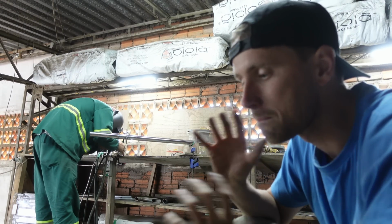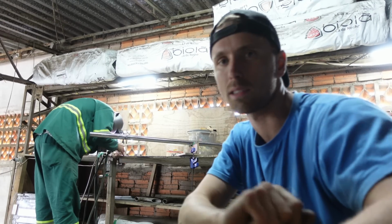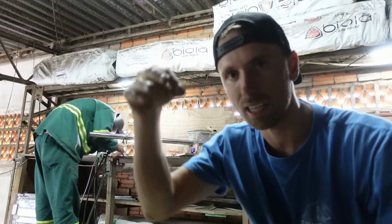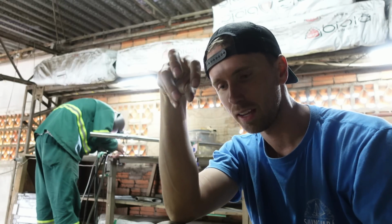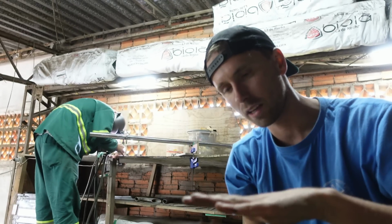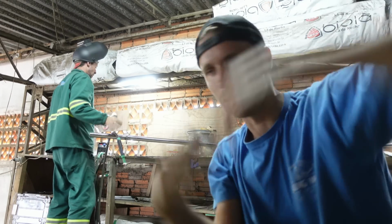And we need one more plate going underneath the platform, where the bottom part of the davit is going to go through. So it's going through the top part, which is what he's welding there. Then it's going to go through the platform, and it's going to come out a bottom part plate so it doesn't wobble at all.